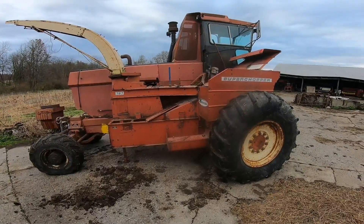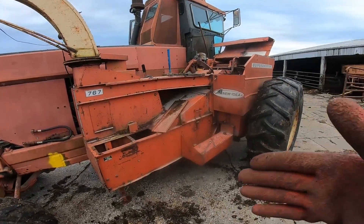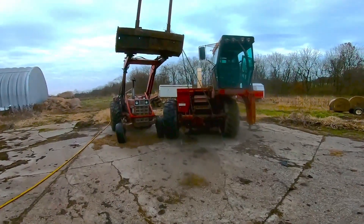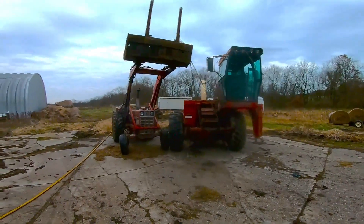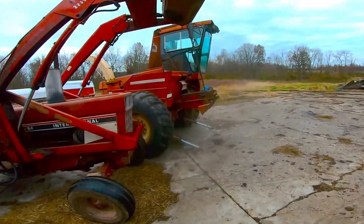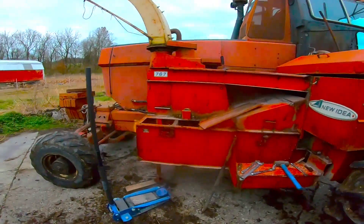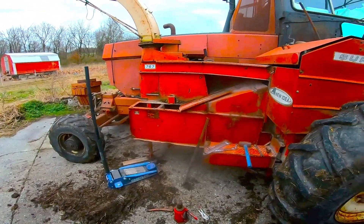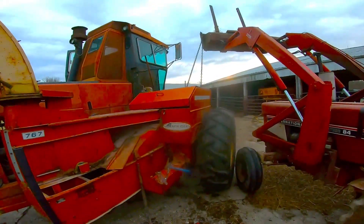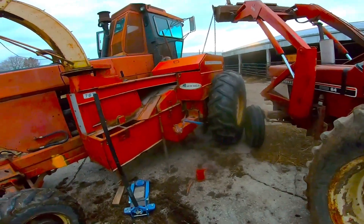The chopper, the head — there's actually two more heads for parts that go with this. But we're trying to get this thing off so we can put the picker on, finally, eventually. The hydro's out and I'm kind of using it to cherry-pick the feeder house and lift it up. I'm using the hydro to cherry-pick the feeder house out front, because I took the head off and not the feeder house, and I don't feel like disassembling any more than I have to.